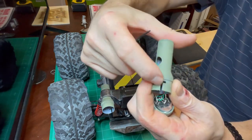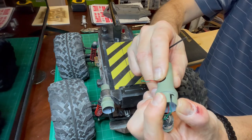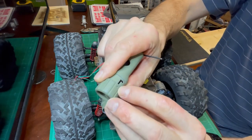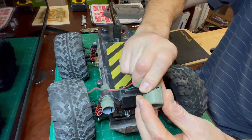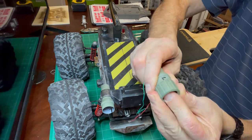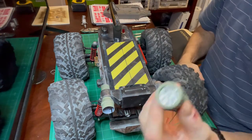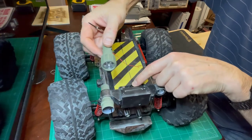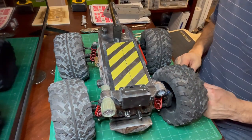Why would I have made a little L-shape on here? Well, when you're pushing this in, it compresses a little bit. If you don't do that, it can't compress and you'll end up breaking it. If you really want to have a latch on it, you could drill a little hole in there and put a set screw — you could push it in and turn it to latch it on. It really doesn't come off at all, so I wouldn't worry about it. The hole in the side lines up so that you can bring the wiring inside the RTV.